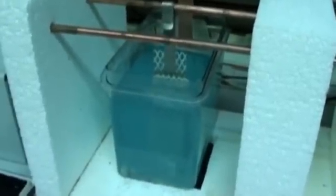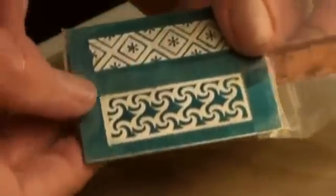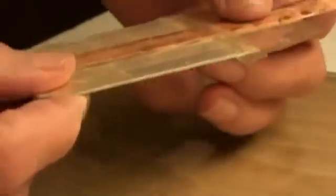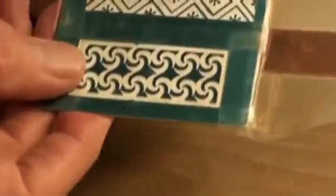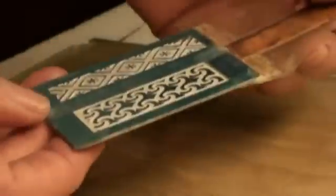When you take it up and check the depth and are satisfied, you are ready to remove the protection tape. It was very important that the protection tape was very neat around the material — otherwise it would have gone through to the silver and made craters in it. Now it is just about ready to continue the process. Here I just want to show you the mounting of a copper strip to make a good contact to the silver, well protected against the nitric solution.